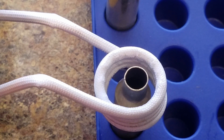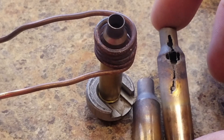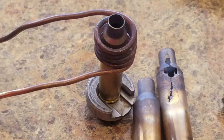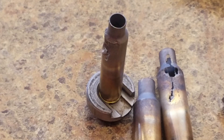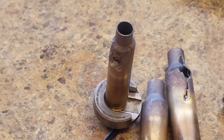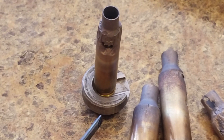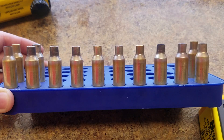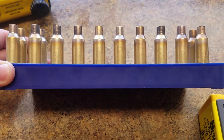This copper wire without insulation gets so hot so fast — I was melting cases in under five seconds. Let me show you how powerful this inductor actually is. That was five seconds — look at that, it just crumpled the case. This annealer is obviously very capable and very powerful, so it shouldn't have any problem keeping up with the workload. I was having pretty good success just doing it manually and counting, looking for that glow, but you can see with the timer it is a lot more uniform annealing across the board.